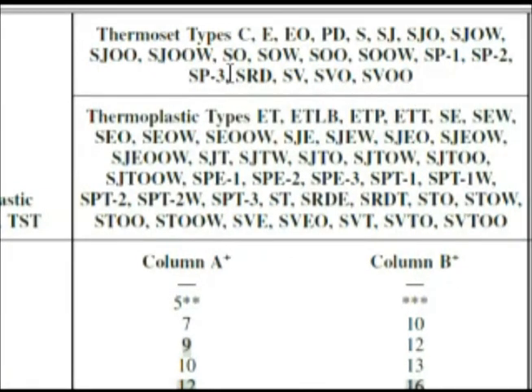I moved the frame over — here's our 10 amps across from the 16-gauge wire in column A, and over here in column B it's 13 amps. Coming up to the top of the table, it tells us what kinds of cables each column applies to, and here's our SJE cable listed — it fits with this column. So our choice for 16 gauge is either 10 amps or 13 amps.